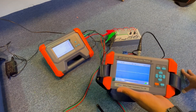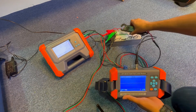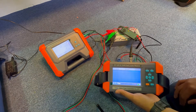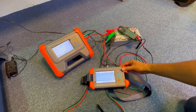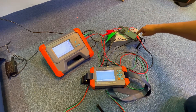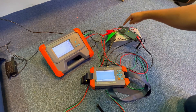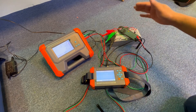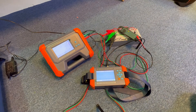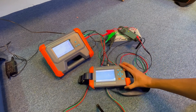Now let's go through the feeders one by one and see which feeder is faulty. Always refresh when you connect to a different feeder. The fault is in feeder one — this is a loop connection, so we created a fault at position four, meaning the signal should show through the loop until the fault point. If the fault is only at position one, it should not appear in others. This helps you identify the feeder and trace you to the exact fault point. You can increase the signal strength to see whether it is faulty or not.